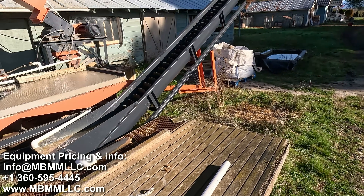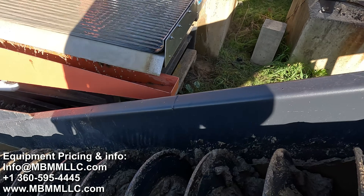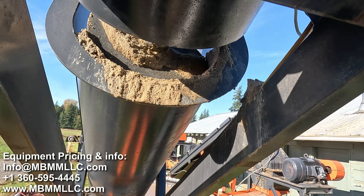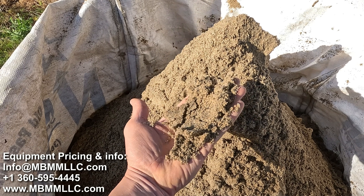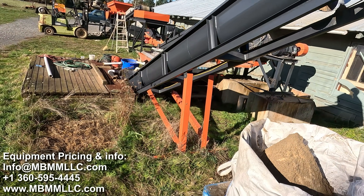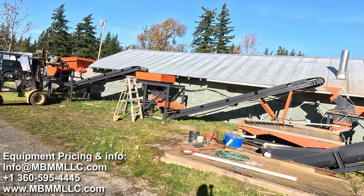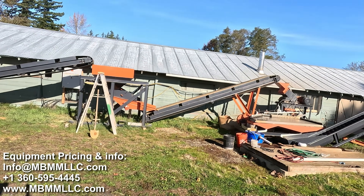The tailings from the shaker table fall into a spiral classifier. The basin at the bottom is where large particles settle and are augured up and out, getting dewatered and discharged into a tailings holding sack. These tailings can be re-crushed if there's enough value to liberate more gold, or disposed of now that they're dewatered and easy to handle. This also prevents your settling pond from filling up, allowing you to run many more tons before cleaning out. All the water in this system is 100% recycled — pumped back through over and over. It takes about 10 gallons per minute, and all the equipment runs on a three-phase generator.